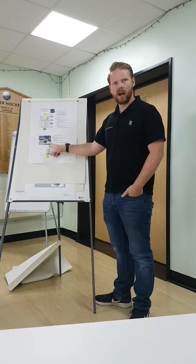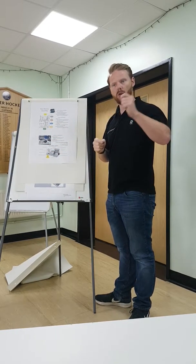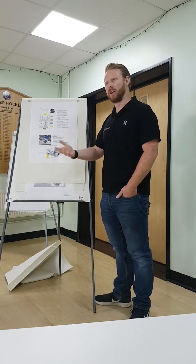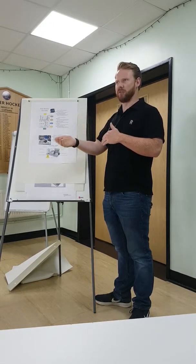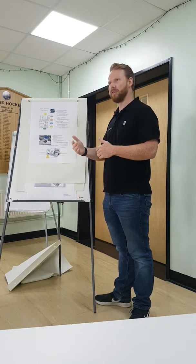The area is very tight and the lighting is very poor — just general overhead lighting, not specific task lighting — and some of these fixings are just a few millimetres in size, so lighting is definitely something that could be improved, which we come on to in the future state. There's also the safety aspect of ESD: the monitor is a very expensive and delicate piece of equipment. The area has an ESD coating on the bench, but then there's anti-fatigue matting which stands between the ESD floor and the associate, negating the ESD floor properties. There's also free-flowing metal tooling which isn't earthed.